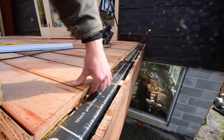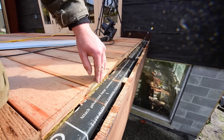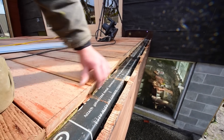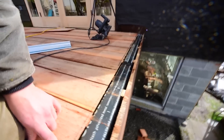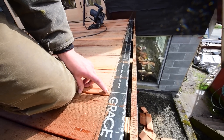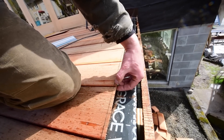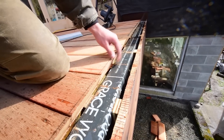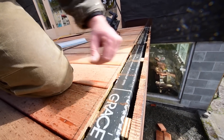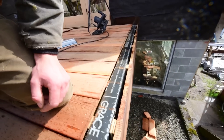That's how you don't cut the membrane. You can see I've got a nice bevel here — almost a half-inch gap for water that gets down into this joint to drain out and allow air in to dry it all out. Now I'm just gonna come back with my track saw set right to my line and square cut these, but I'm not gonna run my saw very deep — just enough to get onto that bevel. Once the boards are up in there you won't be able to see the bevel; it'll look like a square cut.